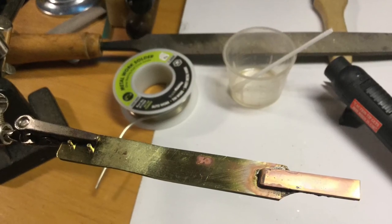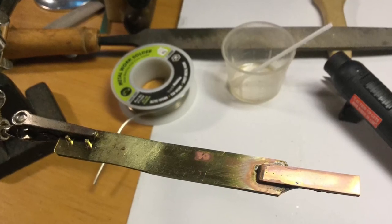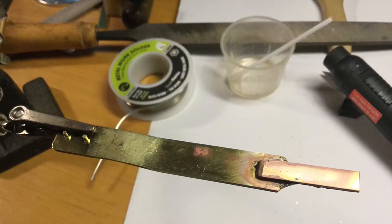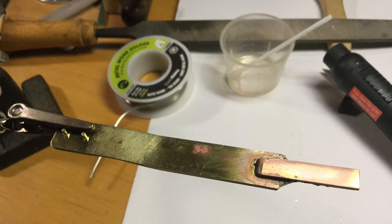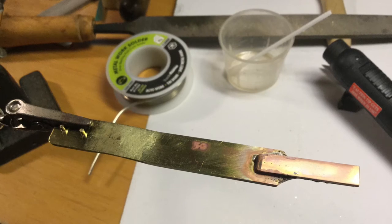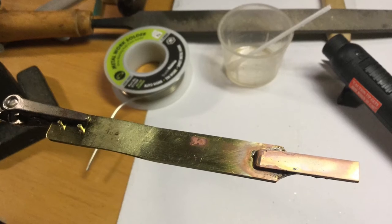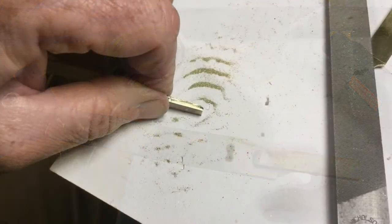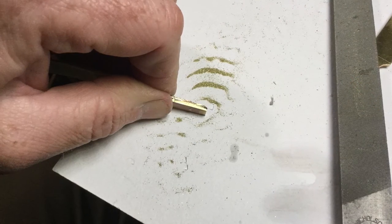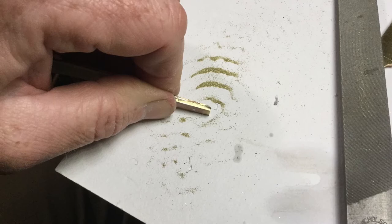I then cut and soldered in place two lengths of quarter-inch brass to strengthen the jaws. It is important to note that these strips of brass are guillotined, which means the underside of each strip is a little bit bowed. So any parts you wish to solder must be placed firmly on a flat file and drawn backwards and forwards until a perfectly flat surface has been achieved. If you're having a bit of trouble making the solder flow beautifully, a little dab of baker's fluid does wonders. It was just interesting that while I was doing a bit more filing on the ends of the jaws, the vibrations through the paper set up an interesting pattern in the brass shavings — I believe the phenomena is known as cymatics.